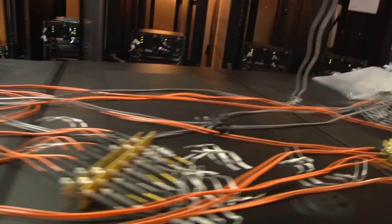What are the ramifications of doing that? Whenever you're dealing with connectivity, every single connection — we love connections because of the flexibility associated with them. You can build the network, tear it down, move it. But any time you're handling fiber, specifically with those connections, that's an opportunity to contaminate the connection. Contamination is actually the number one source of troubleshooting in optical networks today, so you need to make sure that those end faces are clean. If you're not cleaning them, you're introducing a lot of risk for increased loss, damage, and troubleshooting to your network.